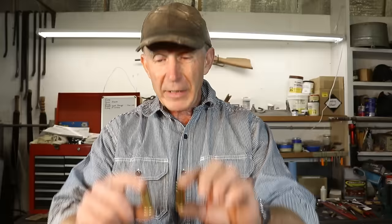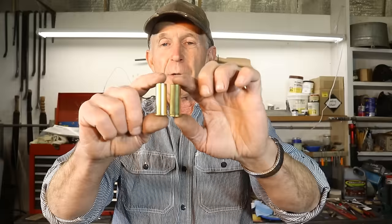Okay, just to satisfy my own curiosity, I went ahead and capped one of these Morse carbine cartridges and dropped the hammer on it. It did exactly what I expected it to. We just put a dimple in this percussion cap in the center of it, and it didn't go off. So we ran over to the lathe, turned down a couple of these 5070s to the proper length, and we can see that these are virtually identical in every regard to these Morse carbine cartridges, of course, except for how they're primed.